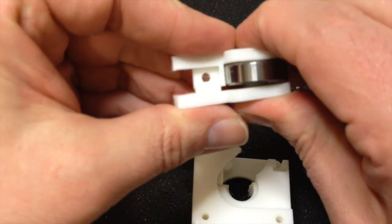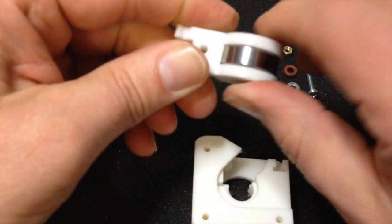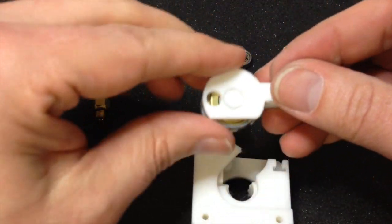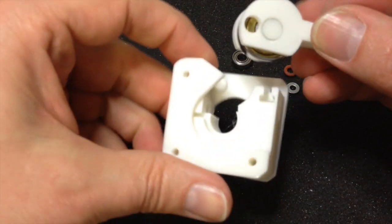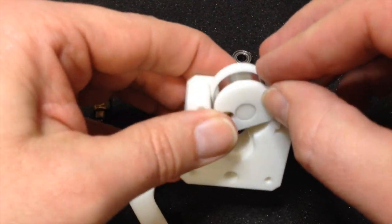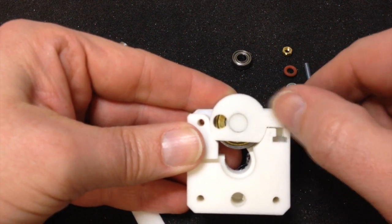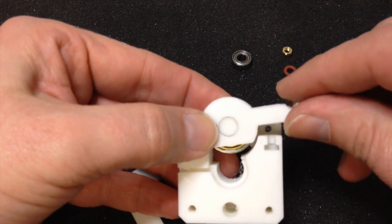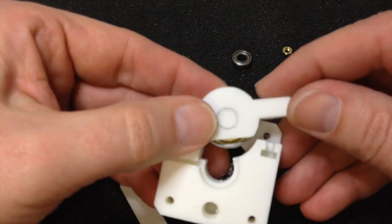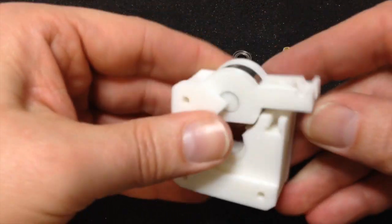Everything snaps together. It can be held together with a little bit of glue, but in usual use this is not necessary because everything fits so well. In the end, all of the parts are held together by the screws of the top and bottom that are screwed into the stepper motor. As you can see, the new mount point for the idler gives you a much better torque ratio from the lever. If you apply force with a screw or a spring, it will exert a lot more force on the filament and on the drive gear, giving you a lot more pressure through the tube going to the extruder.